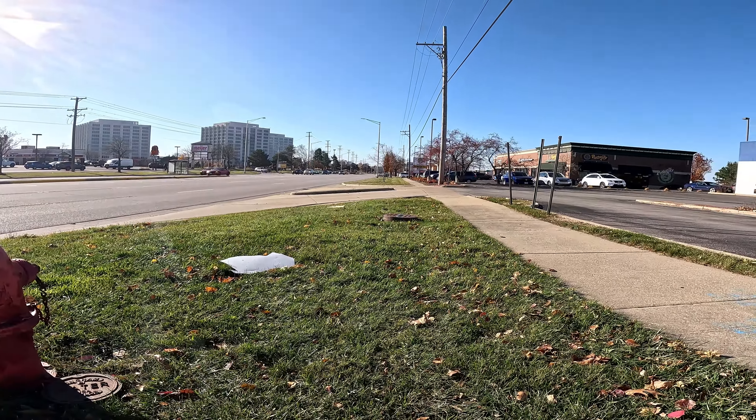I don't know why all these people are looking at it — they probably think I'm nuts. So what I'm going to do is go per print off measurements — 116 feet, 118 feet — go all the way down, mark it off measurements, and tell the contractors to dig it up. Folks, I hope you like this short video — please like and subscribe. One more thing: I failed on this one. I could not locate the water main. It's not due to locating — it's due to the print description sheet. The print is wrong. I believe this water main curves and goes to a fire hydrant. I don't think anything goes that way like the print shows, because I got a tone turning. Alright folks, please like and subscribe and have a great day — bye.